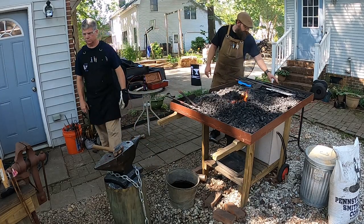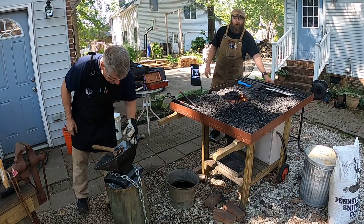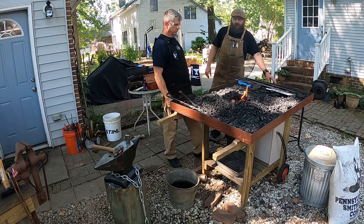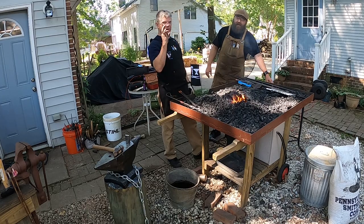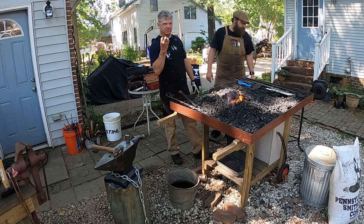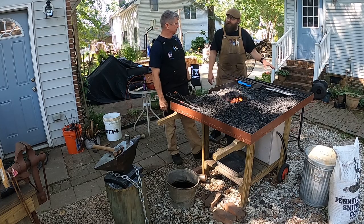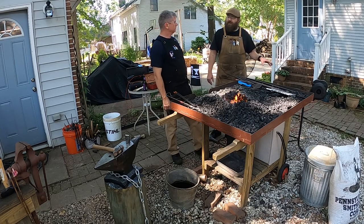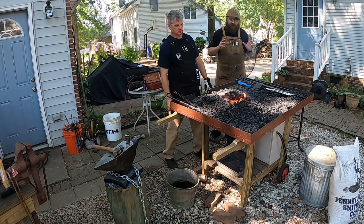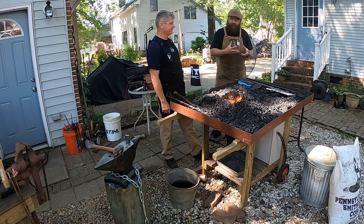Cast iron is almost impossible to forge or weld because of the chemical composition of it. It's almost like pig iron. You don't know what type of impurities there are in it. It's very granular, the way the metal molecules line up, very granular. I do work with guys that have welded cast iron, and they say it's almost as dirty as carbon arc. It's really, really nasty stuff to work with. It sputters all over the place just because of the chemical composition and how it's formed.